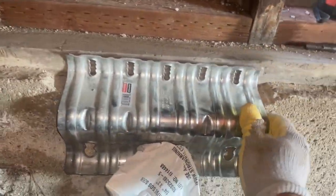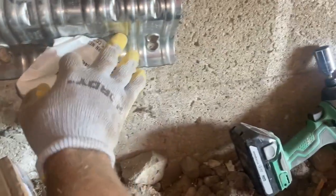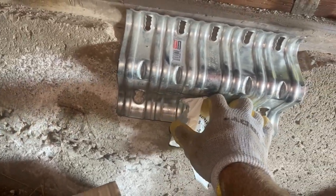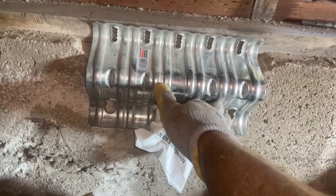This spacing here is just about six feet between this one and this one. I'll come in and screw in just the two-and-a-half inch screws to hold it in place, then drill out the holes for the concrete bolts, and then finish screwing everything in. I'll show you how that all looks.